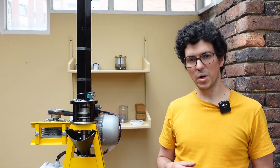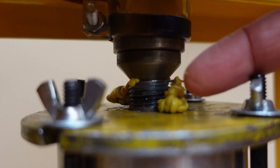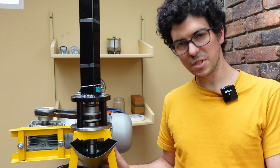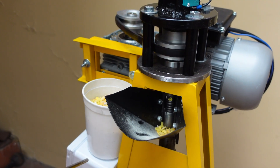The second thing to be aware of is if you find any leakage in the entrance of the mold. This can mean that the mold is already full or that the connection between the mold and the nozzle isn't tight enough. Now that the injection is completed, we want to refill the barrel to keep a continuous process so we don't lose time waiting for the plastic to melt.